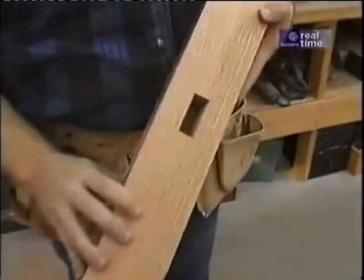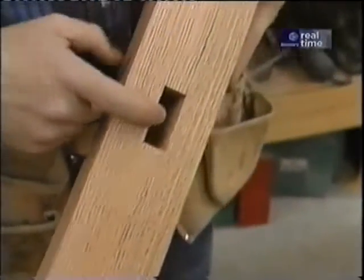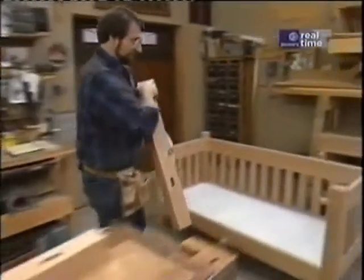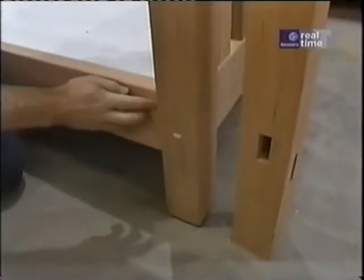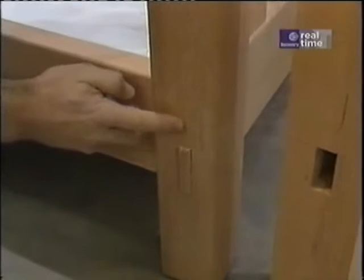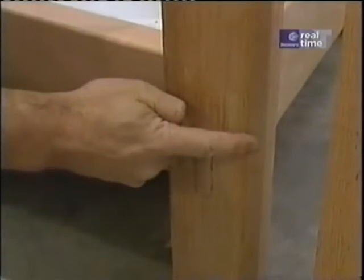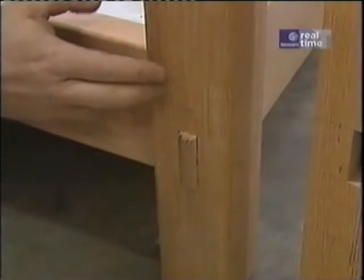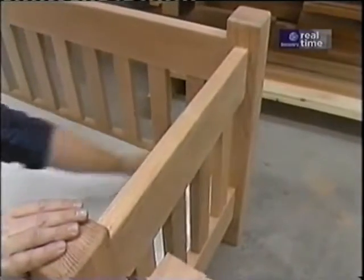I've just completed cutting one of several mortises that I need in the sides of the post. These don't go all the way through — they're only about two and a half inches deep. On the prototype, the cross rails also have tenons and they actually pass over the tenons from the side rails but don't go all the way through — I felt the post would be stronger that way. On the front post I need only one side mortise because there's only a lower rail, but on the back post I need two: one for the top rail, one for the bottom rail.